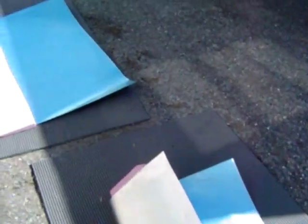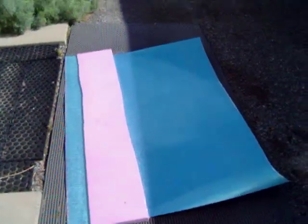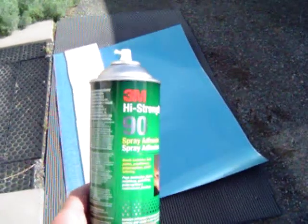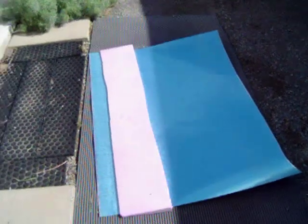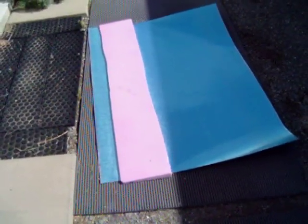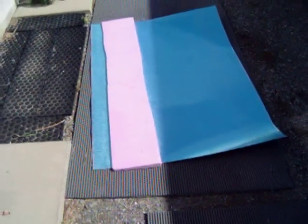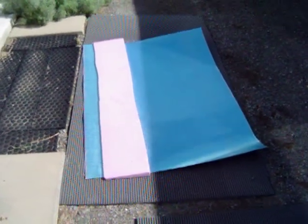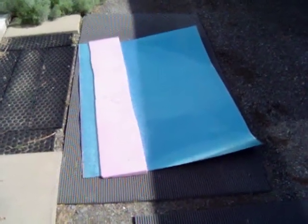That's the one part in process, and this is before I fold it over. I've used the product that's designed for polystyrene — it's a 3M high-strength 90 spray adhesive to attach the foam to the aluminum skin. As you can see, it's blue on the one side. The reason I was able to pick it up so inexpensively was the fact that the blue plastic protective cover does not want to come off.